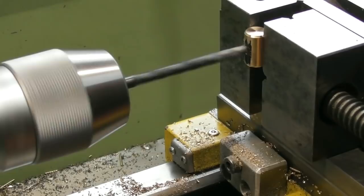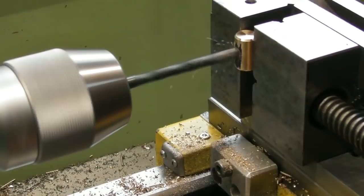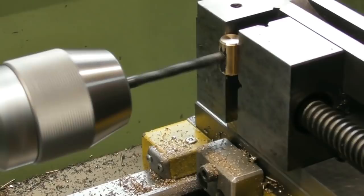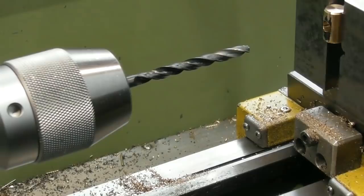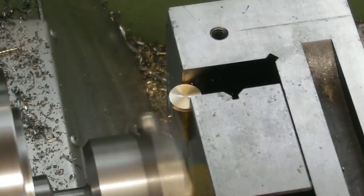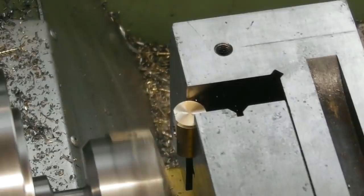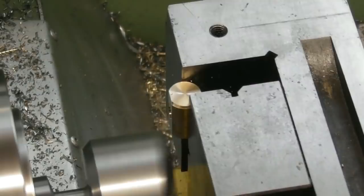I'll just start this very gently because I don't think I went deep enough. That's the 6.2mm hole drilled — plenty of clearance on the 6mm bolt. I'm going to put the fly cutter up now and skim off the front face. I'm taking it very gently, just going to fly-cut that down until I've got a face width of about 8 to 9mm — so not cutting it completely in half but just enough so that the tightening knob has got a flat face to sit against. That's 1mm deep now, 1.5 or 1.6mm.